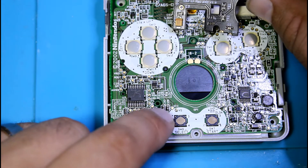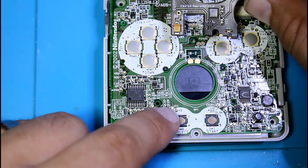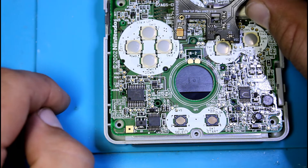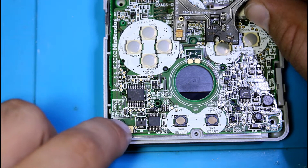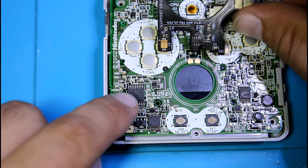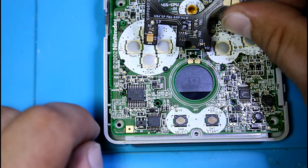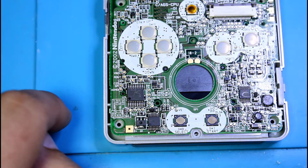On this one we're going to be using these capacitors here. But since the AGS-101 does not have these capacitors or much of the circuitry, we will have to use an alternate point. I'm going to put the image up on the screen where you need to actually scrape a little bit of the green coating on the PCB — the solder mask. Then you can just solder a wire from the ground point, which is this one here in the corner, to the area that's going to expose the copper by scraping the green coating.